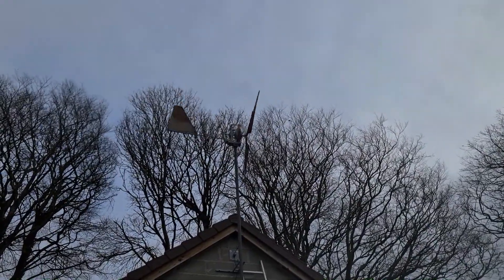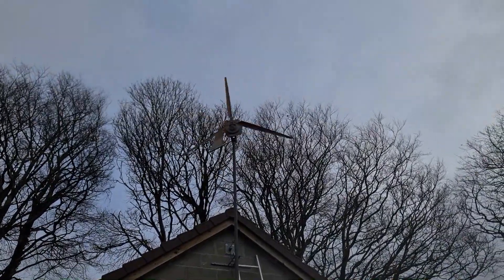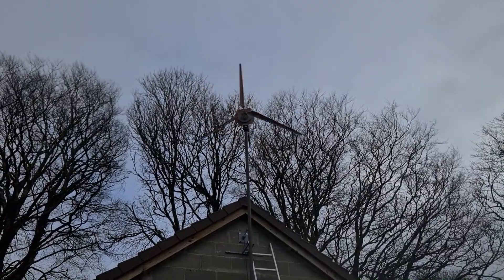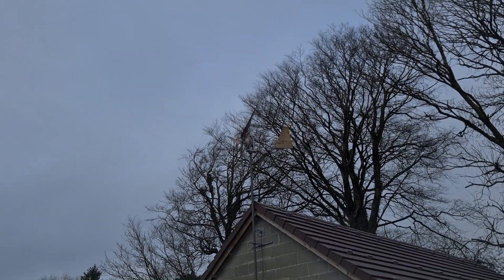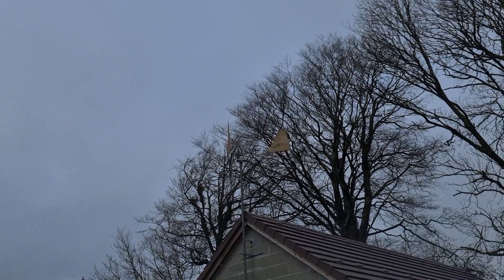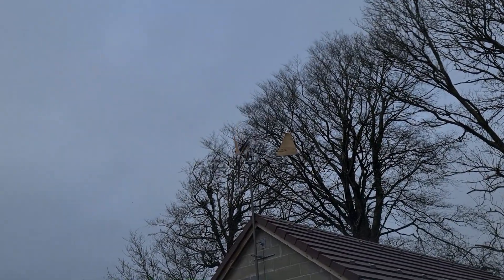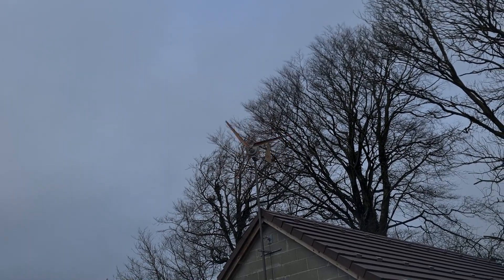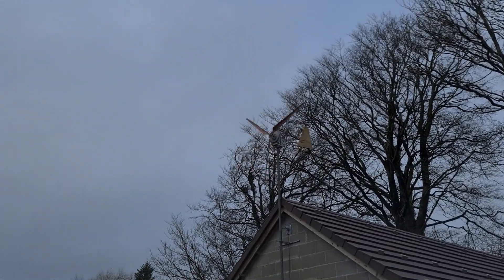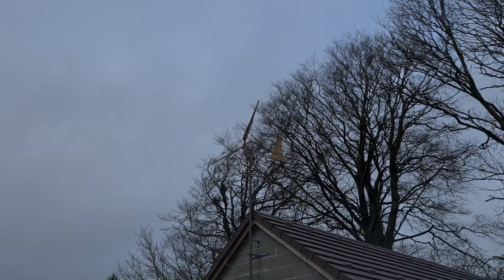It's a little bit gusty and the wind direction is moving quite a bit, but it's going — encouraging. One of the reasons I made it the size I did is that this area is prone to sporadic wind bursts. It's not an open area — lots of trees and buildings — so we won't get clean wind. But I made it quite heavy so there's a lot of momentum in those blades, meaning it won't stall completely between gusts. For the most part it does seem to keep rotating.